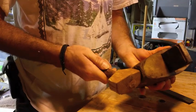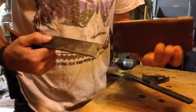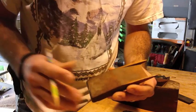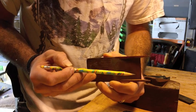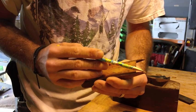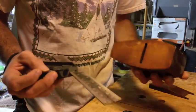Ask direct questions about condition. Hit it from the rear, pull the wedge out, keep your hand under the bottom — be sure that the iron doesn't fall out. Look at the condition of the wedge, check whether the points come together at the same distance, and look for any splitting. This one has a little divot here and a little divot there, but you're going to get that from use, from the chips hitting it.